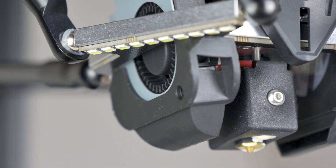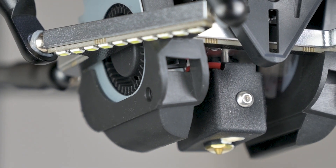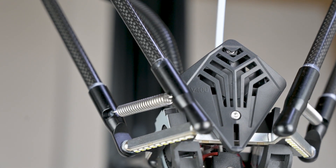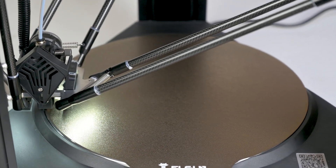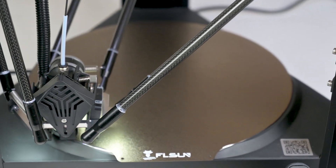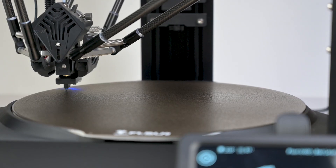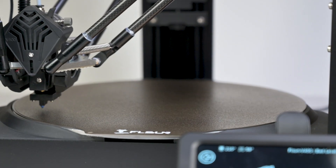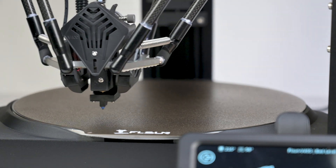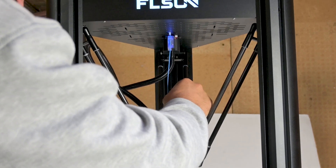To support those speeds, the printer has double cooling fans on both sides of the hotend, and it can print up to 300 degrees Celsius, meaning you can print materials like nylon. There are also LED lights — personally I don't love them for filming due to the light temperature, but they're great for seeing your printed parts. The printer does auto-leveling, and since I did it once I never had to re-level the bed — no adhesion problems whatsoever. The filament goes through a filament sensor and straight into the direct drive extruder mounted on the print head, making it easy to swap filaments.